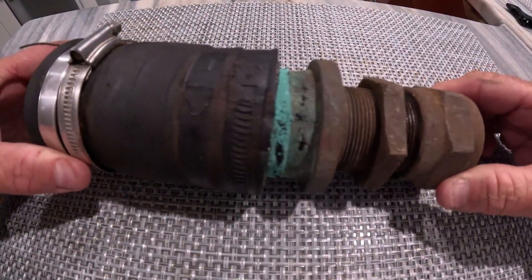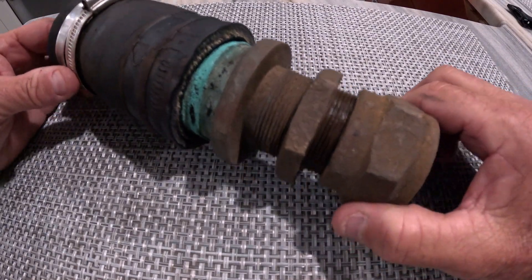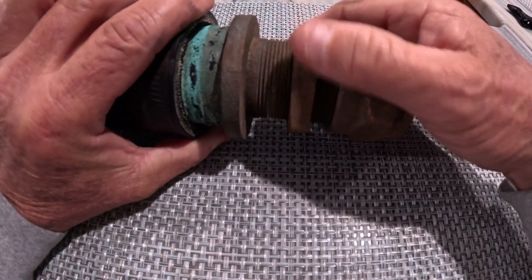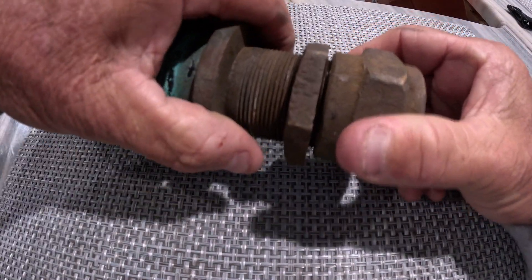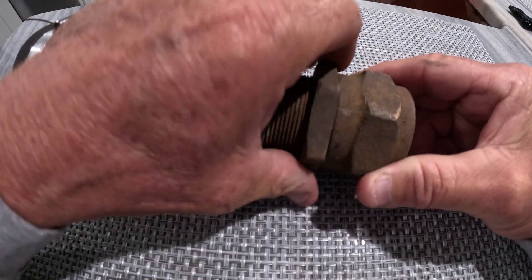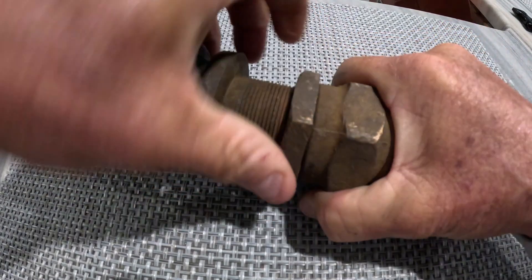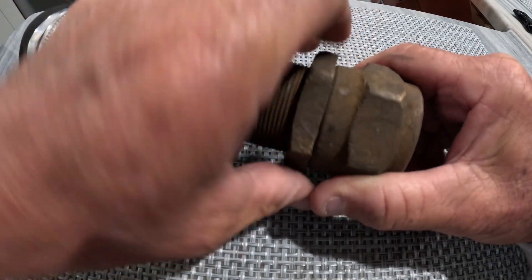Okay, I'm back at my office and I wanted to show you the same setup that we just worked on on that sailboat. This is called a traditional stuffing packing nut — traditional because it's brass, nothing really fancy to it. This is the locking nut — see how it tightens right down. Once everything is all the way in and as tight as it can be with the stuffing, you back this nut down to the bigger nut just like that, and tap it — pipe wrench doesn't matter — but this locks it from backing off. This little nut right here is the locking nut, so you want to back that down to here and then it won't undo.